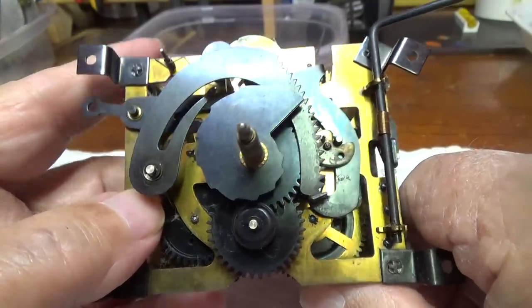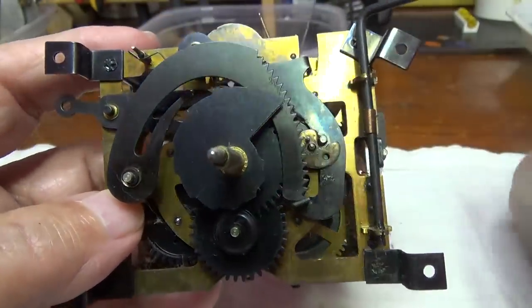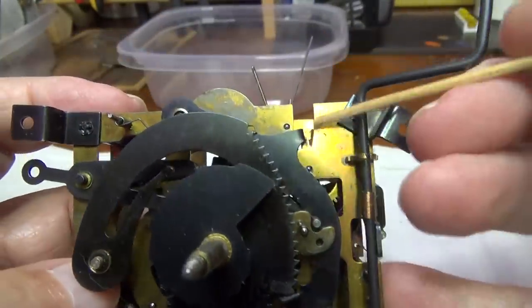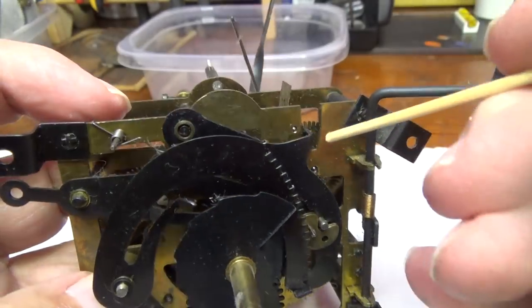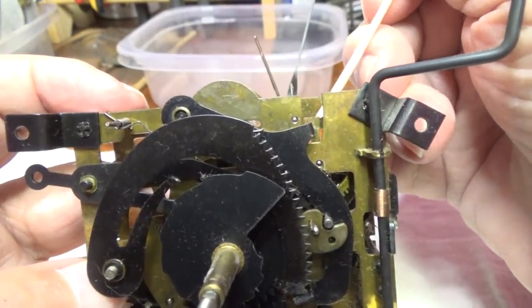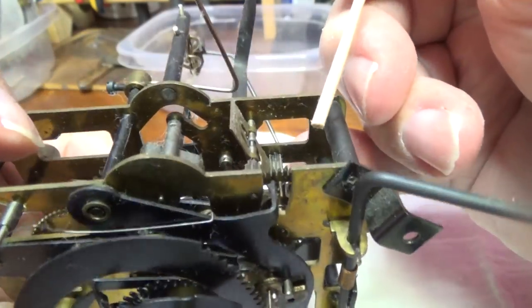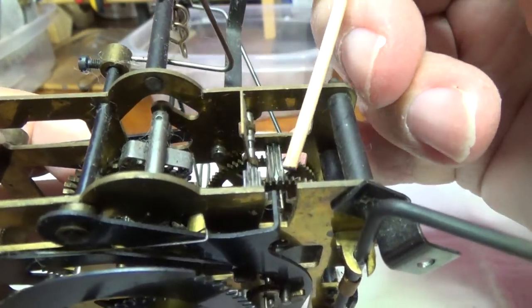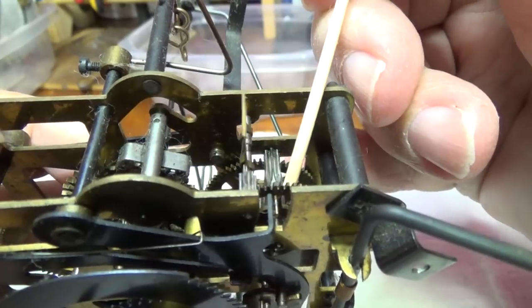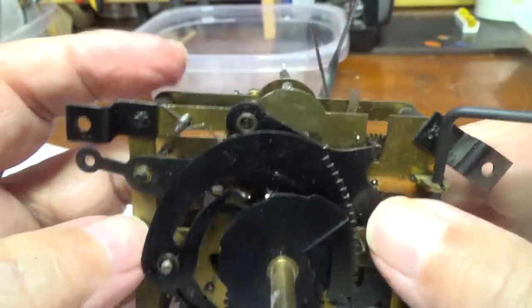And it shuts off, okay? When this piece drops underneath the end of the rack, that allows this piece up here to fall in front of a pin on this wheel. And that pin is what stops, there you can see the pin down there. That pin is what stops the cuckooing. All right, so